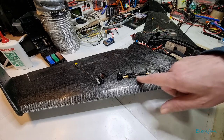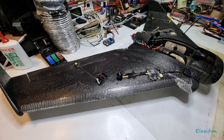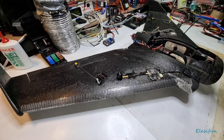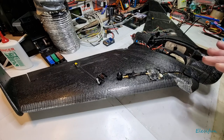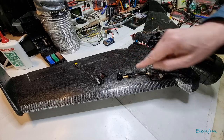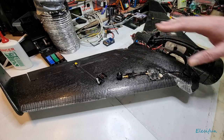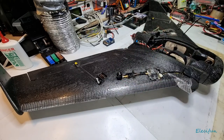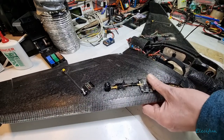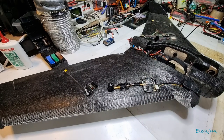But on this setup, I'm using this little antenna here because it's got a radiation pattern more like an apple, rather than like a donut, rather than like something that's been compressed to squish out further. It's more just all around. So above it's going to be a little bit better, and below a little bit better, and just more all around. So that's what I'm using on this anyway. And hopefully this is going to see me good. I'm not going to use above the legal limit in my country. I don't feel that you need to if you've got a decent receive antenna and a decent receiver.